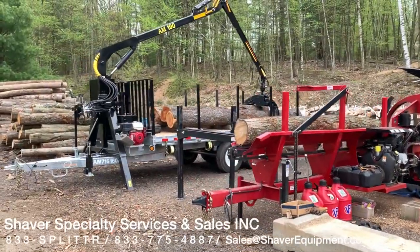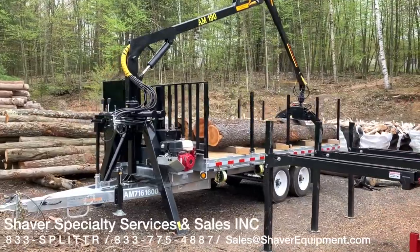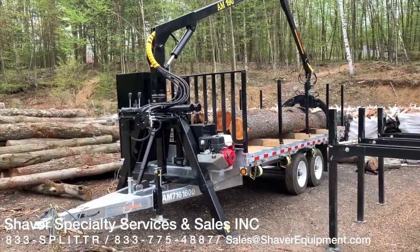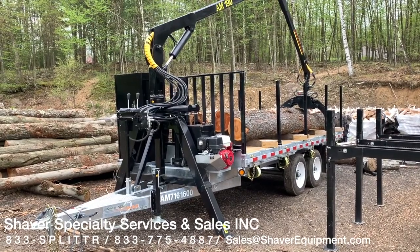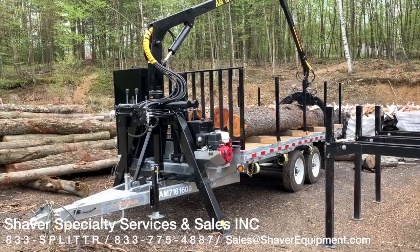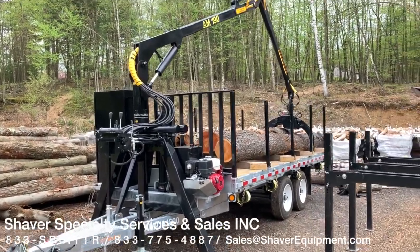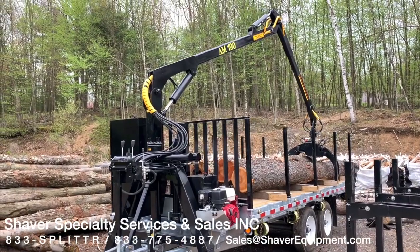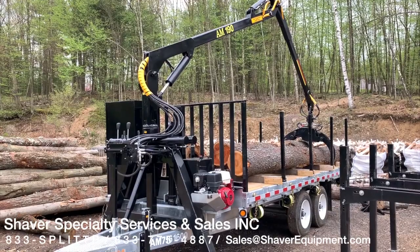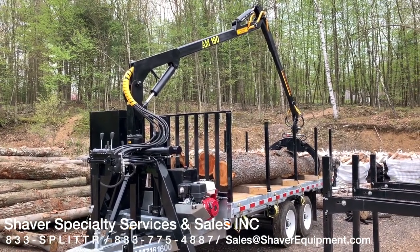So this is the new AM Machinery 716 1600 deck over dump trailer. The 7x16 or 716 stands for 7 feet wide, 16 feet long. 1600 is a 16,000 GVWR, sporting the AM 190 log loader. That means it gets 19 feet worth of reach from the center of the trailer out and picks up right around 3,000 pounds at the half reach mark.